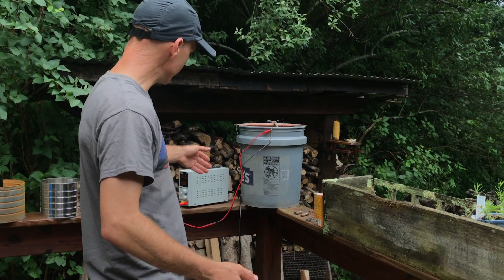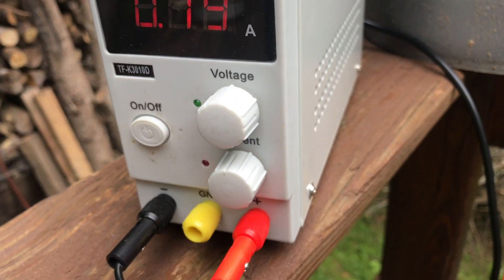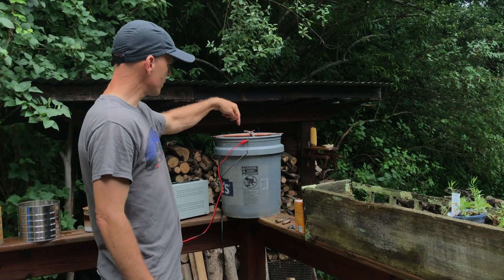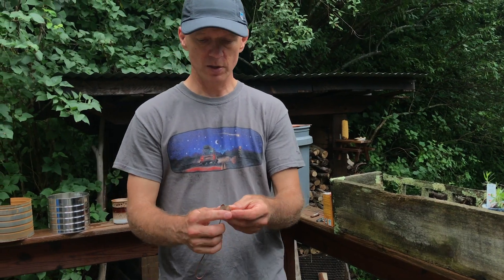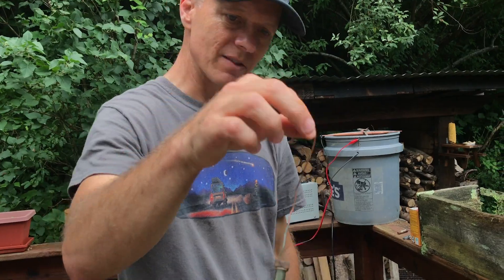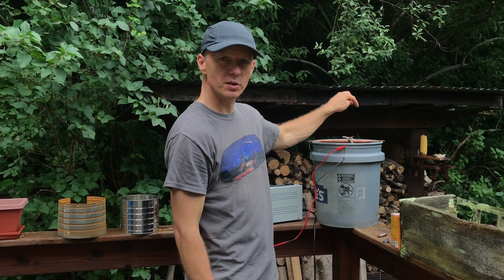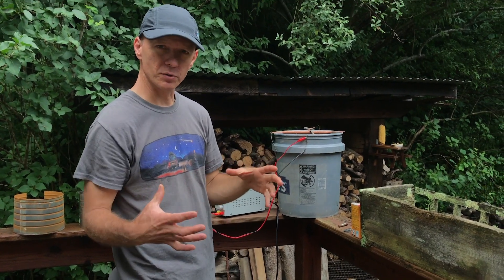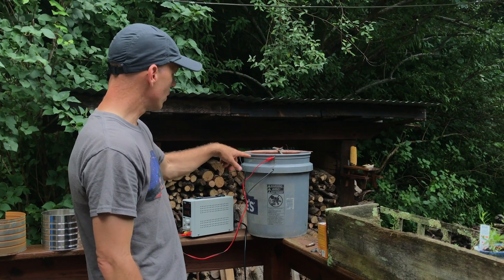The way I've done this is I have an electrical controller that I can set my level with. You can also use battery chargers — look it up online, there are people who use all kinds of different things. I have a copper tube up top. I've taken wire and wired in my pieces that I'm going to remove the rust from — I just wind some copper wire around the bolt, which creates a connection within the solution. I take this and simply hang it on the pipe. Negative goes to the item you're wanting to clean. Positive goes to the anode, the sacrificial steel, the coffee can.